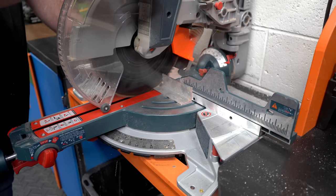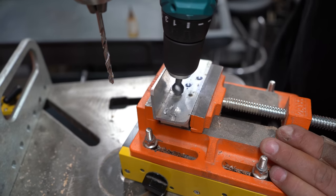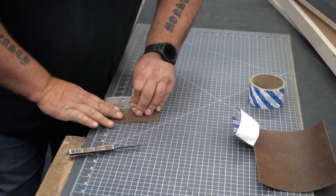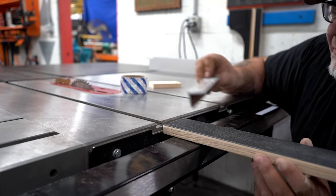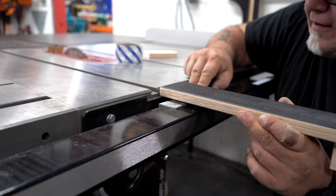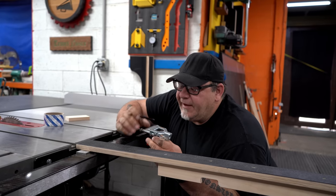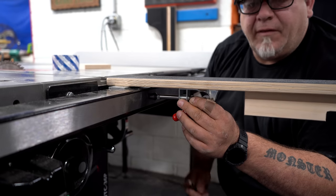This little bracket is about five inches long and it's super easy to make. It's aluminum — a softer material — so you can cut it on the chop saw and drill it with regular woodworking tools, including tapered holes. Once that's done I put a little bit of non-slip rubber on the face that goes against the bar side, and a clamp adds extra grab. I've got my holes drilled, my cork rubber on, and a little double-sided speed tape to position it. I put it down on the bar, hold it tight, bring the top piece up flush against the front of the table saw, get it centered, and push down — the double-sided tape holds it in position. Then I flip it over, pre-drill, and put my screws in.